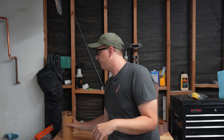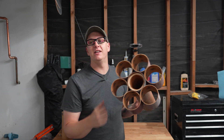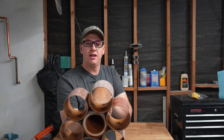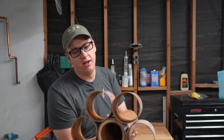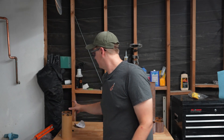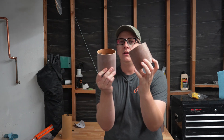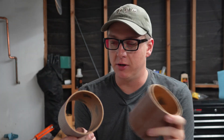The fiberglass won't stick to it, you get a really nice smooth surface and it's very easy. So instead I'm going to do it the hard way — actually there is a reason. If you're familiar with this build, I accidentally cut up what turned out to be a full-length coupler tube for these tube fins. There are actually a couple splits between the sets of tube fins, and I tried to make them the same — I failed. We're going to fill those gaps, but what that left me with was two pieces of fiberglass coupler. However, because they're fiberglass they don't fit in the tube and they'll be too short.